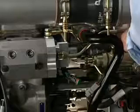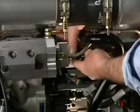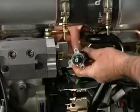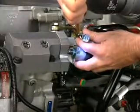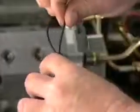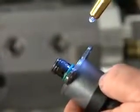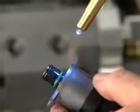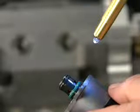Remove the cap screws that hold the fuel pump actuator to the actuator housing, and remove the actuator. Inspect the actuator pins for wear or corrosion. Closely inspect the pigtail harness for wire insulation damage. Inspect the plunger through the 3 fuel passage windows. A shiny, scratch-free surface indicates the actuator is acceptable for reuse. Any signs of scuffing, especially when accompanied by intermittent fault codes 449, 2215, or 2216, indicate the need to replace the valve.